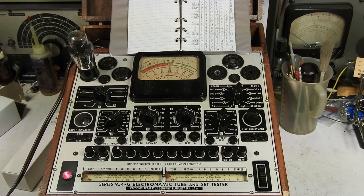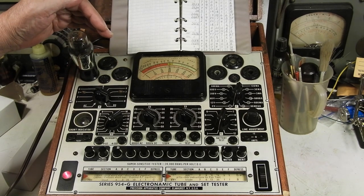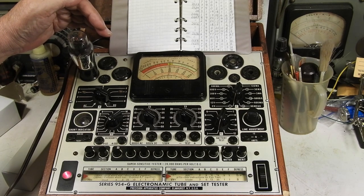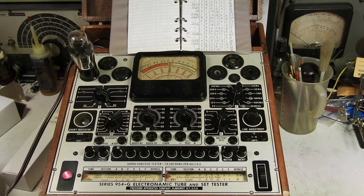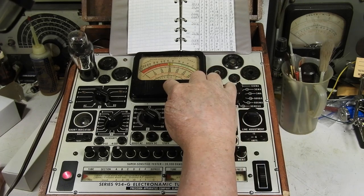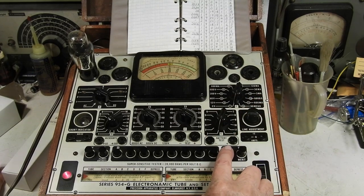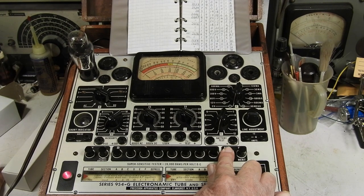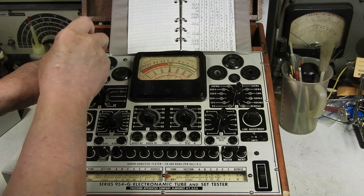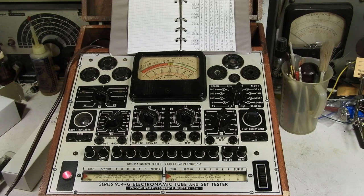Again, the filament's going to start heating up. Yeah, I can see that it's glowing. I'm going to give it a little bit of time so the cathode is heated up all the way. Yeah, I'm beginning to see the cathode glow. So, let's see here. Yeah, the meter is in the center. So now all I have to do is hit read. Okay, we have another good tube. So we got another good spare for that Philco 112. Hit filament continuity. Now it's safe to unplug the tube. And we're done. Thanks for watching.